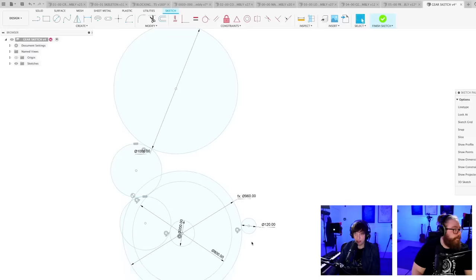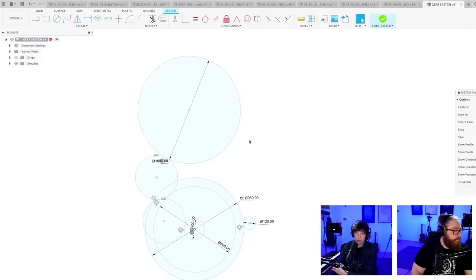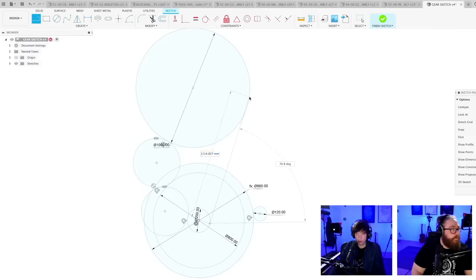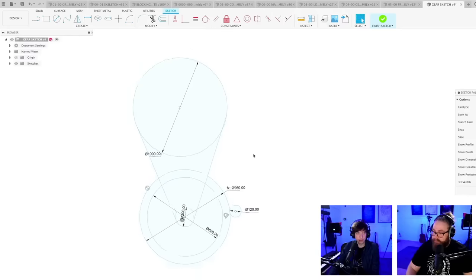I'm just going to check the rotation. So this would be clockwise. This would be anti-clockwise. This would be clockwise. This would be anti-clockwise, and this would then go the wrong direction because that would be clockwise, and we want the programming wheel to go anti-clockwise. So these two filler gears, not only is it a lot of extra steps, I think from a mechanical power transmission point of view, to have a belt between this gear and straight up to the big one, compared to transmitting the power over these two in-between gears, is just way, way more elegant. You can kind of see it immediately if I do this.